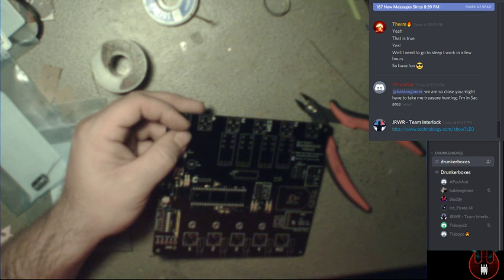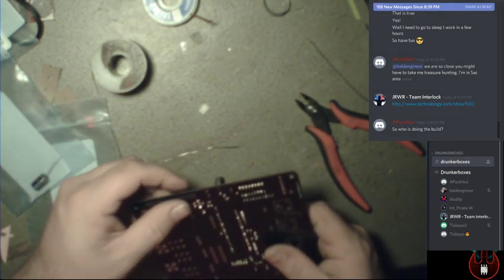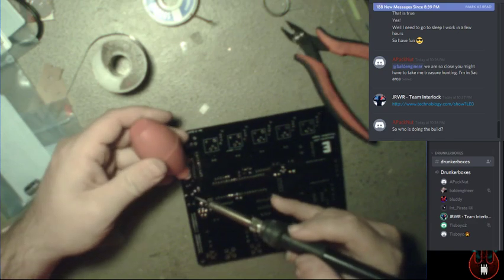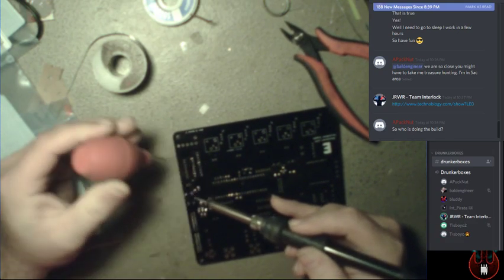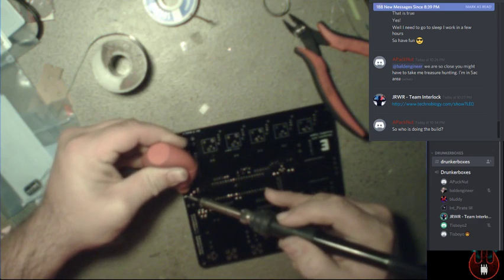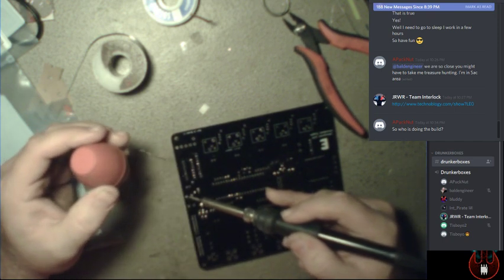So, like I said, the only issue that I had was trying to change pin 3 and 4's PWM at the same time. It wasn't exactly happy with that. It would skip a cycle. But the way that I have them designed is pin 3 is the bottom LED and pin 4 is the top LED. So they'll never be on at the same time if I'm just doing a rotation animation.